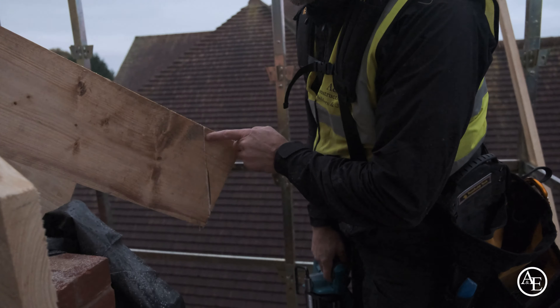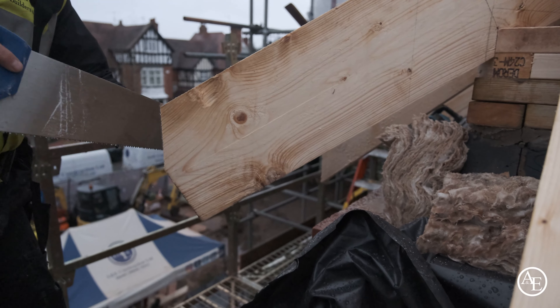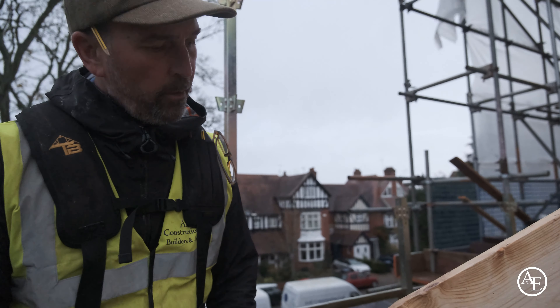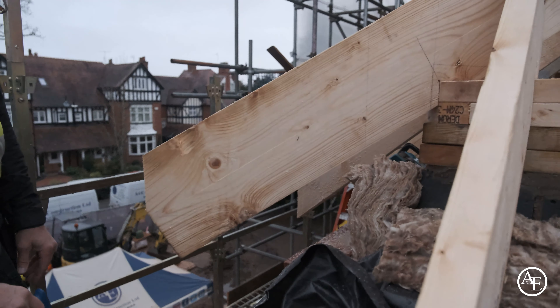So always remember that. You can see now I've caught the line back in. I always like to lead the line slightly in like that, take about half the line out. I'm not worried about this obviously not finishing all the way through because of the undercut. And then by the time I bring that stud work through, it'll all latch on and be nice and strong anyway.